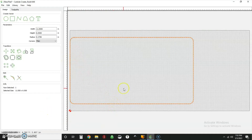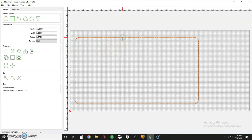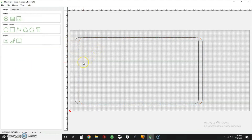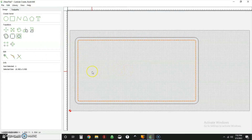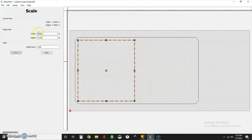I don't want it all the way up against the edge of the stock, so I'll arrow it over a bit. Now I'm going to make a couple of segments inside here. I'll do a copy and paste, delete that, and offset this to the inside a quarter of an inch. Then I'll transform this box — since we made it 11 inches long, I'm going to set this inner box at 5 inches.